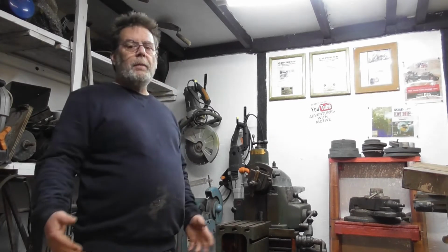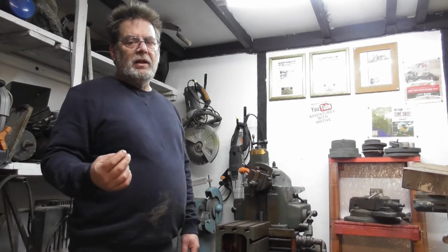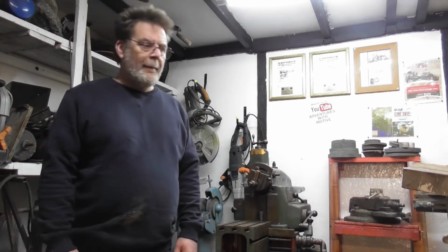I would like also to drain out the existing diesel, but I don't know how many years that stuff's been in there. It's probably gone to water. There's a thing called a diesel bug that I learnt in boat building. There's a possibility I've got gunk growing in the tank as well, because I put a lot of diesel in that 2 years ago and it hasn't even budged the needle. So I'm wondering if the sender unit has jammed up somewhere along the line. Now if I take the sender out and it's rusted, or bits of it are rusted where the steel is, because I know they're all plastic, but the arm there might be metal parts in there. If it's showing signs of rust, then we know the diesel is shot, and then we need to remove all of that. Cue the intro.